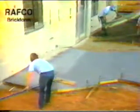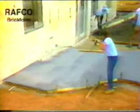When the concrete has been smoothed out, begin applying the color hardener using the broadcast method. This will provide a richer, longer-lasting color, but more importantly, the color hardener will absorb any bleed water. A single application is usually sufficient, although some additional color may have to be added after the color is worked in.